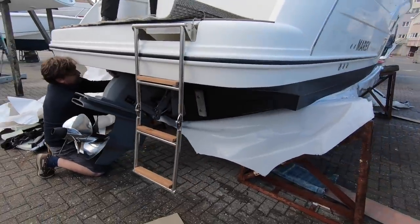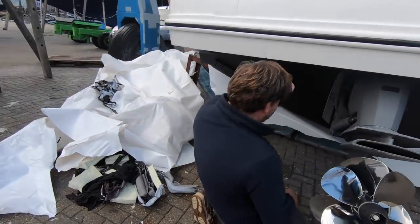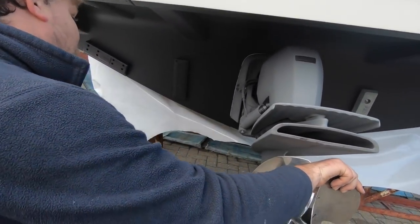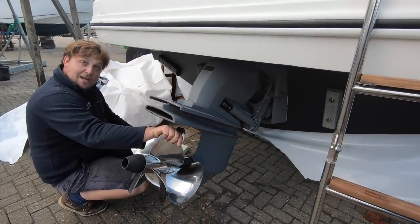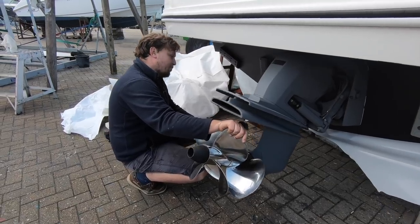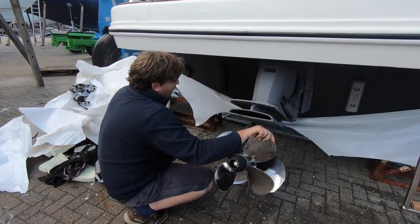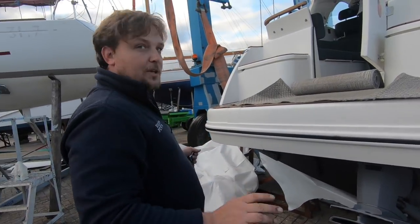Next, it was time for Seb from Golden Arrow Marine to perform the pre-delivery inspection, or PDI. What does that involve? Not much really, just a general check of the bellows, check of all the steering hoses and the trim parts, all the necessary equipment really. Yeah. Check the oil, which is the main thing. And there's not much to check on these, but so far so good, pretty robust units. So this doesn't involve firing it up, sea trial, not here. We do that when she goes back in the water. We just do a low speed calibration, check all the gears and everything.